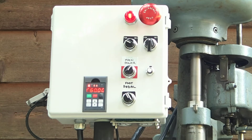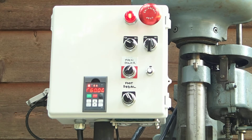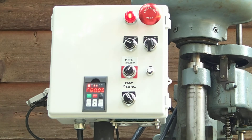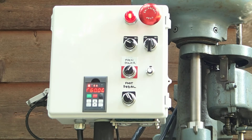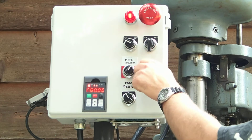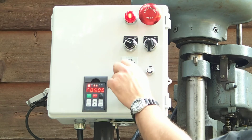It has a long quill travel on her which works really well. Here's the engaging worm rod, and you get your four feed speeds. It automatically disengages, and it will automatically kick off the drive when it hits the stop down here. I'll give you a little walk around and show you quickly inside here.